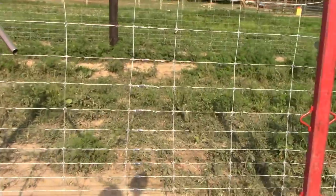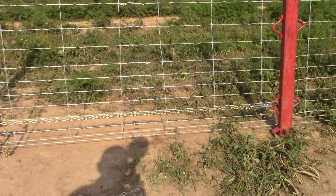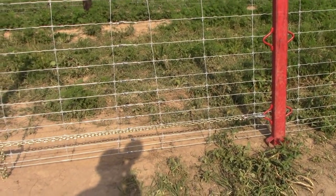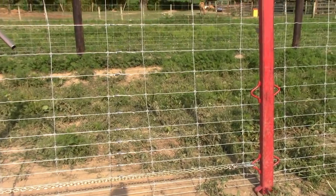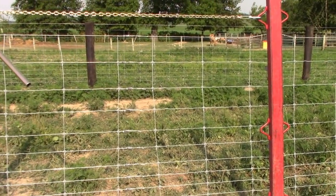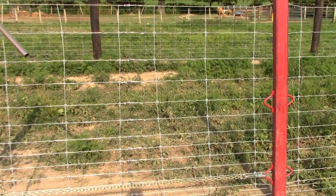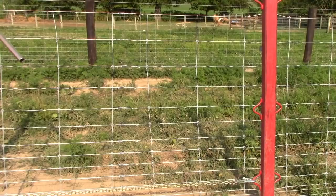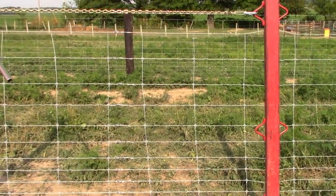I don't know if you can tell that those stays are a little bit wider at the bottom than they are at the top in our join there. This is a short run and it does have a little bit of a dip to it, so that's one benefit of a gut strain. You can make your adjustment in the middle where it needs to be, in my opinion. We can strain to an end and make the adjustment also, but this is just a little bit easier.